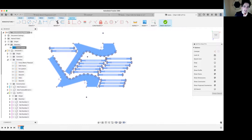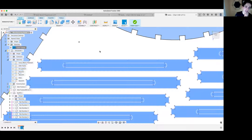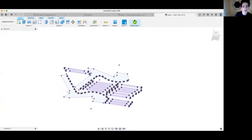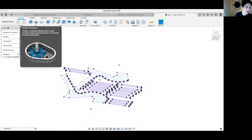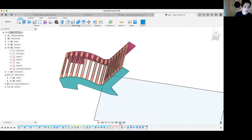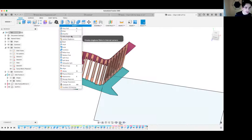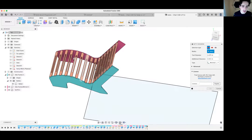Sharp corners are fine for laser cutting since laser cutters can cut them, but not for CNC. So go back to the design environment, go to Modify, and after your plugin is installed you'll see the Nifty Dog Bone buttons. Click Nifty Dog Bone. Our tool diameter, unless discussed otherwise, is 0.375 inches. Select everything — you have to do it at the body level, so you can draw a box or select individual components.